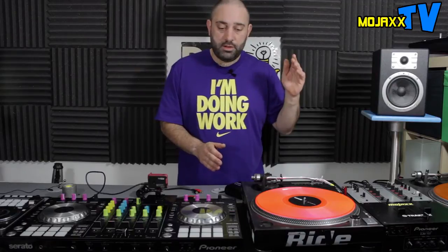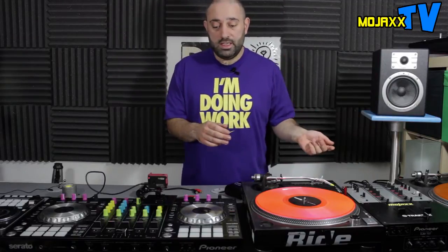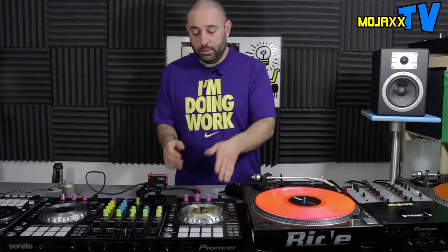So you've got earth going through the mains power and you've got an earth going through, let's say, your controller through the audio cables into the sound system, and somewhere else that's earthing somewhere else, and those two earths then clash, and what you get is a ground loop, and that makes a horrible humming or buzzing noise through a system. You can turn down your faders and listen and you just hear this horrible, nasty buzzing noise. It's not something you want to deal with at gigs.